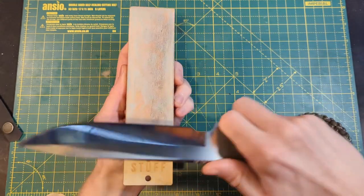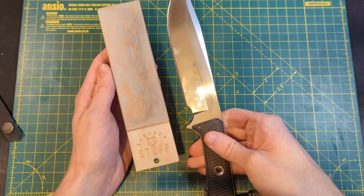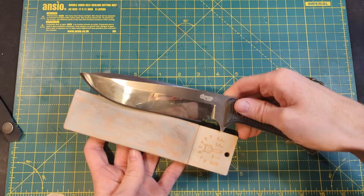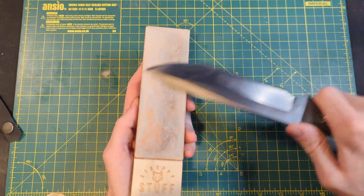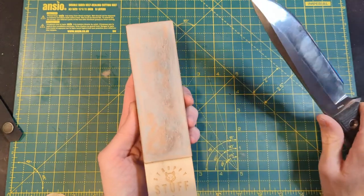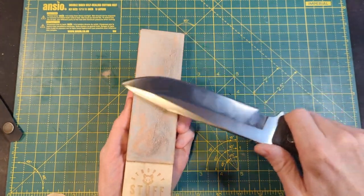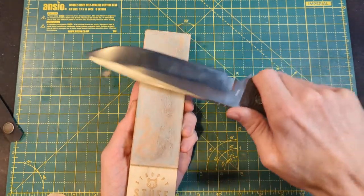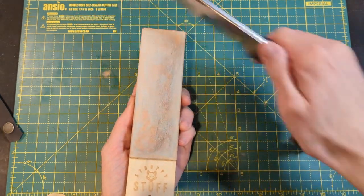You really only need to do a few passes with this in the first place. Look — the cutting blade is as long as the strop here, and this is a big blade and it's easily stropping the whole thing. And if your blade was twice the size, you can strop the belly a bit and then strop the heel a bit separately, if that's the way you want to do it.